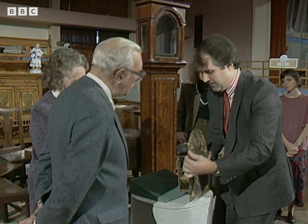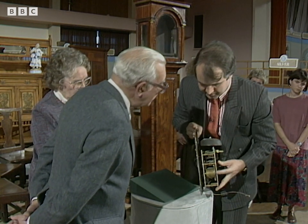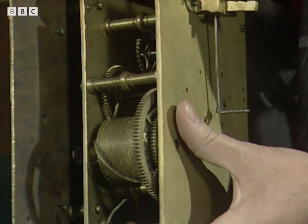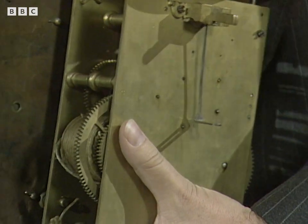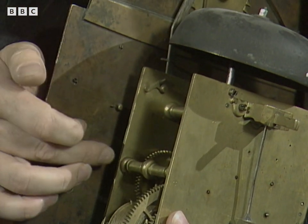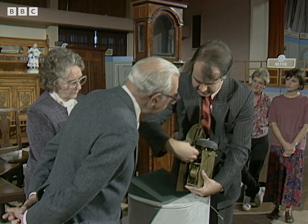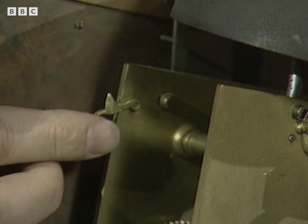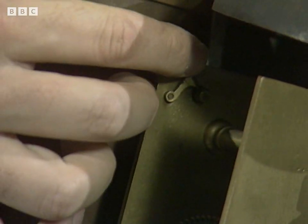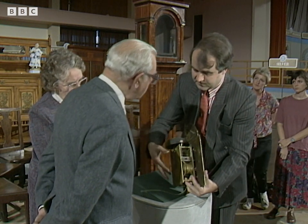The joy of this, really, is the absolutely lovely movement. We've got six ringed pillars — two you can see there — and all the pillars are latched. The normal method of fitting pillars together is to pin them with a steel pin, but here on this dial foot you've actually got a little latch which just swivels round. So when a clockmaker wants to take the clock to pieces for cleaning or whatever, he can just literally take it apart with a flick of a few fingers. A wonderful, wonderful clock.